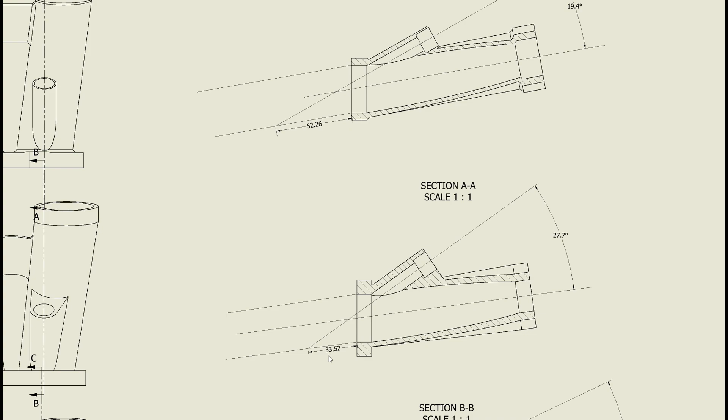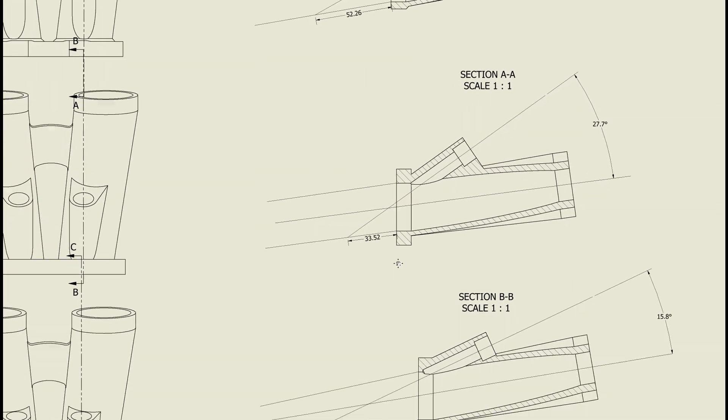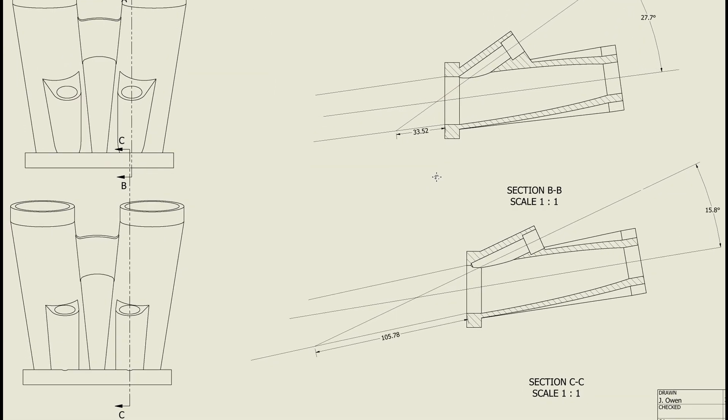What I've done is reduced the angle and brought the injector port a lot closer to the back of the flange where it meets the cylinder head. Look at the difference it's made - 100 millimeters, just over four inches in, which is a long way into that port. That's actually a good contender. Maybe I need to have another think about this - let me know what you think. Anyway, back to the last bit.